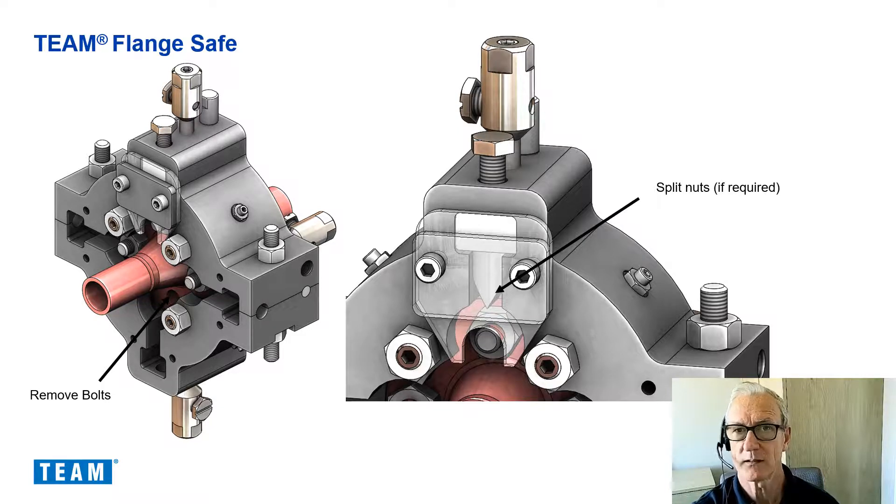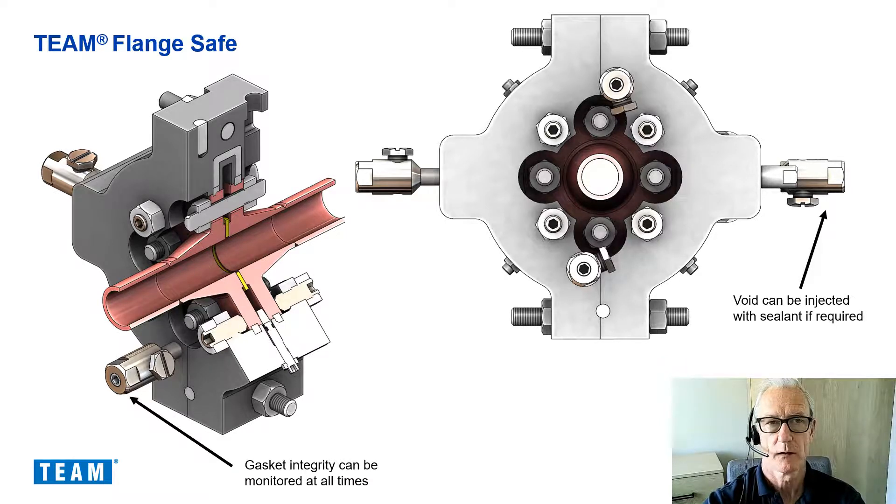This whole process has been engineered to change out the bolts with no movement of the gasket and therefore no release of product, allowing the FlanSafe tool to be reused on the next flange assembly and allowing the replacement of multiple flange assembly fasteners online. During the whole fastener renewal process, we can monitor the gasket integrity at all times and if a product leak is detected, we can use our on-stream knowledge to quickly seal the flange assembly. In this scenario, the FlanSafe tool will have to be left on the flange assembly until the next available turnaround. We are committed to helping companies maximise asset uptime. Our FlanSafe solution ensures any loss of product caused by gasket degradation or bolt relaxation can be safely contained. The system also maintains joint integrity in the event of complete bolt failure and total flange separation.